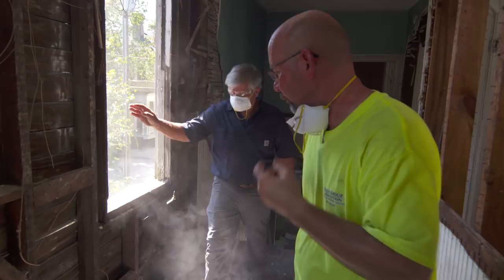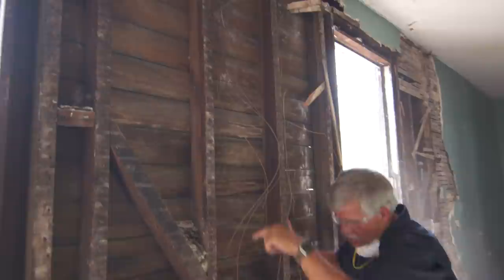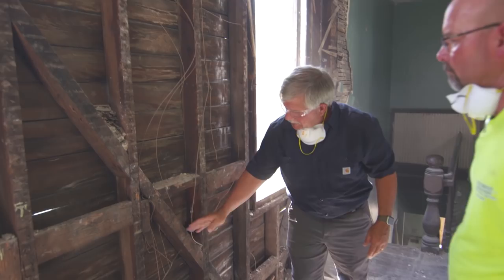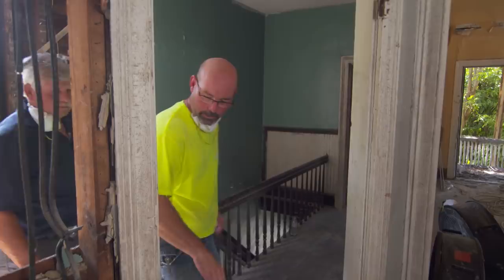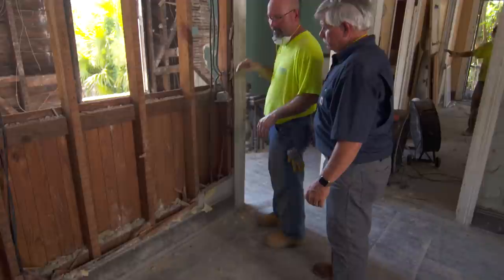Right up here on the right-hand side, we've got some balloon framing. Balloon framing is actually a lighter framing — it's when you have a two-by-four or a stud that goes all the way from the top plate down to the sill. It's a lighter framing, but it's nice to see this diagonal bracing in there — that's not done very often. Right in here we've got some casing that goes all the way up and around, with a face board down here on the bottom. We're going to leave this in place on this particular project.